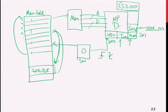Okay, and this interrupt was also somewhere in my code. Okay, serial ISR. So whatever I'm doing, if suddenly this event happens, I must stop whatever I'm doing and jump to my ISR. Correct? Finish it and then carry on again. Okay, so you can have a lot of interrupt service routines in your code to handle all the different interrupts that your system is expected to handle.